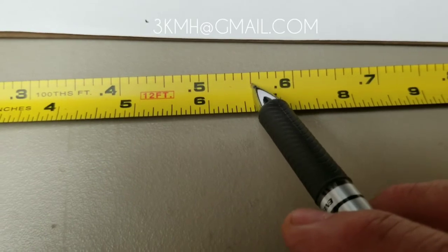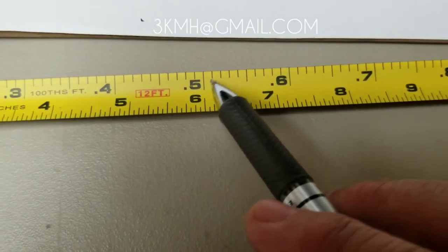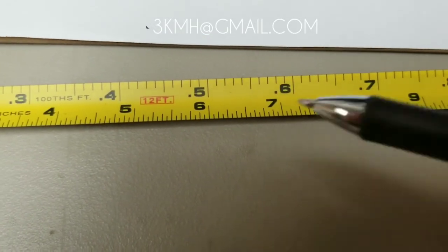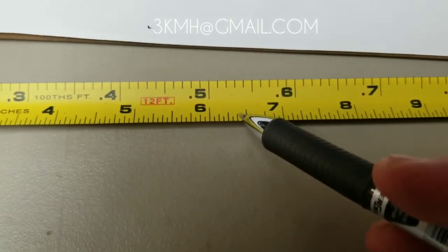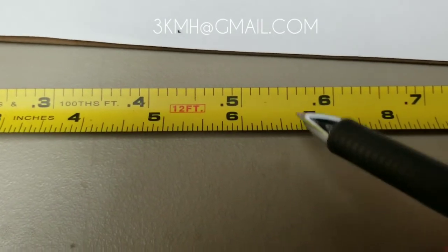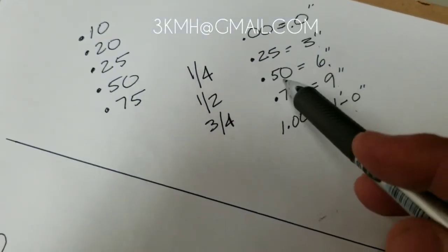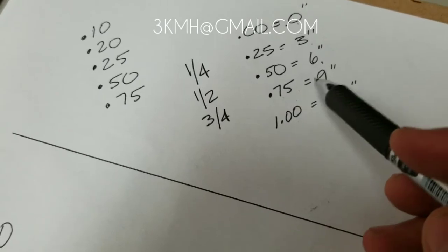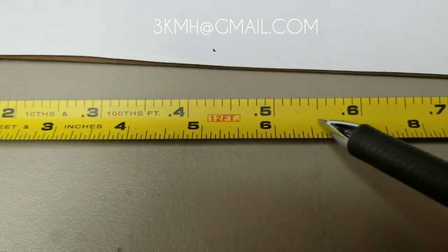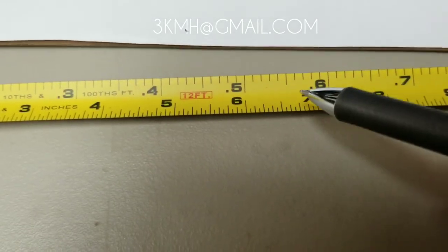The five line is going to be a little bit longer on all of them. But that's it — .5, then 1, 2, 3, 4, 5, 6. To me, it makes no sense to try to convert hundredths back to inches, because other than .25, .50, and .75, nothing's an absolute. There's always going to be a little wiggle room. Because we deal in hundreds, use the hundreds. These pocket tapes are cheap.